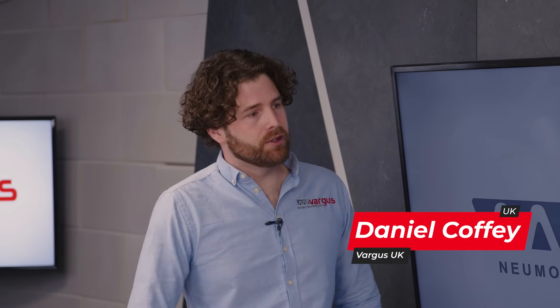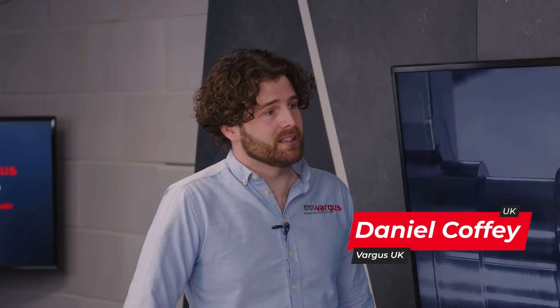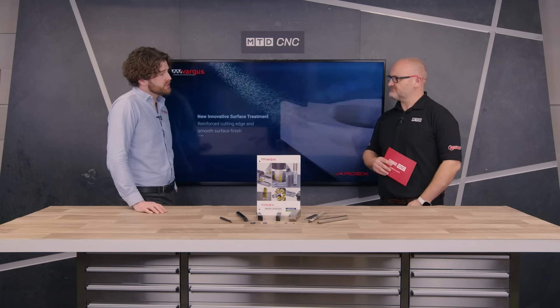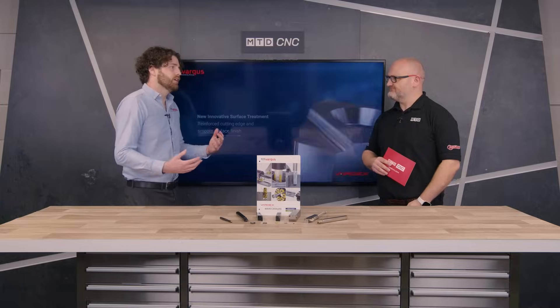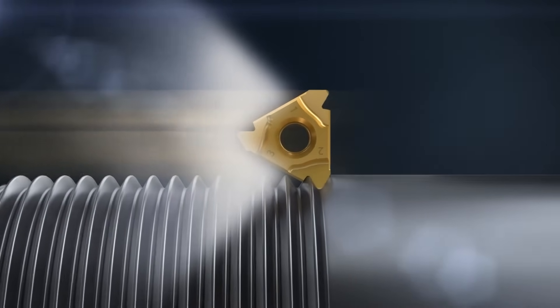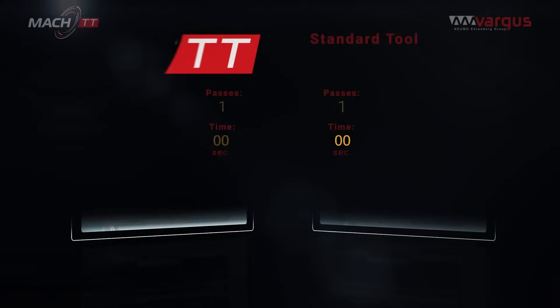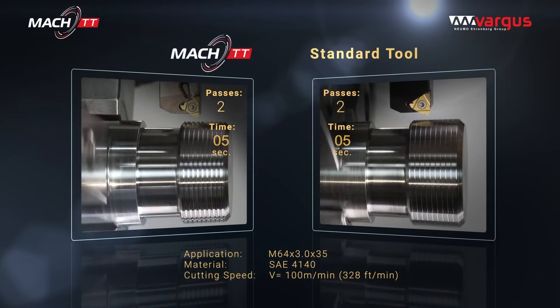I just want to really give an overview of the products that we have in our ISO thread turning range. We're very well known worldwide as being the leaders in thread turning, and I want to expand a little bit on it — go over some of the grades we offer and some of the inserts we have to give people a better overview of what we offer. We have over 30 different thread forms available as a standard insert, so we cover a lot of people's needs without having to go down the road of producing a special.